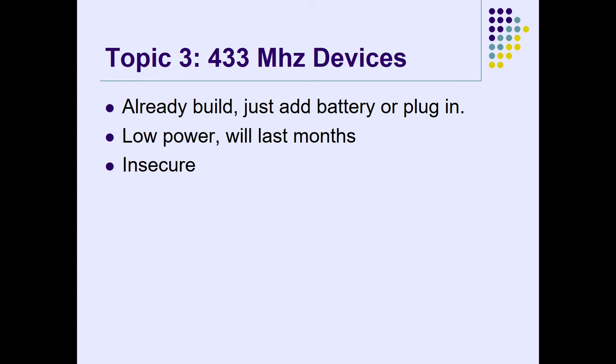Are most of these devices one-way communication? Yes — they're usually one-way. These devices all send a 24-bit code and the receivers receive the 24-bit code. If you want to check if something's currently turned on, there's nothing that does that. Whereas if you built your own, you could probably code it to do that. With that said, this is insecure. You can sniff somebody's neighbor and trivially ring their doorbell.